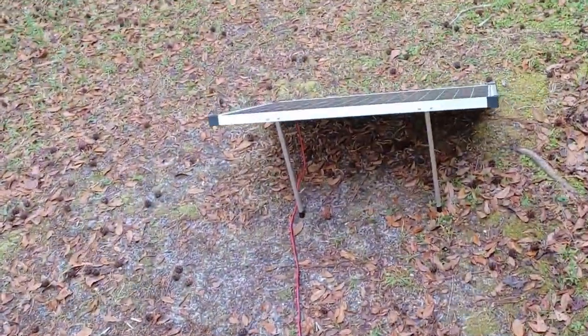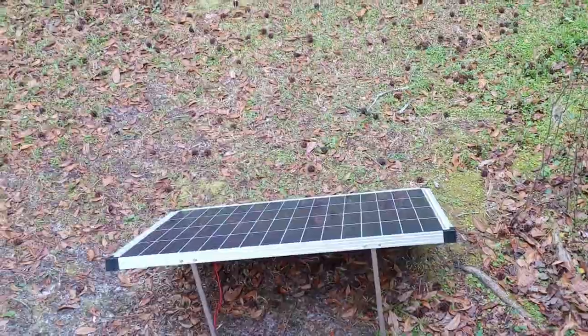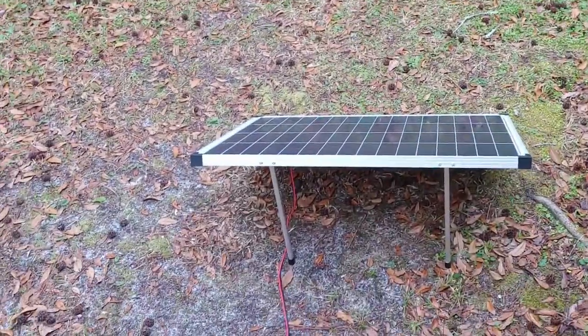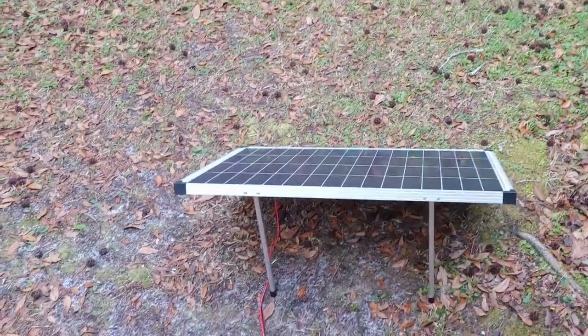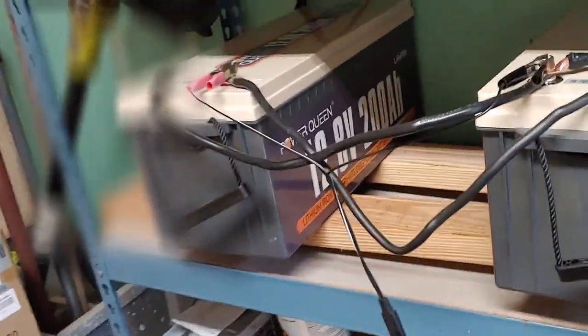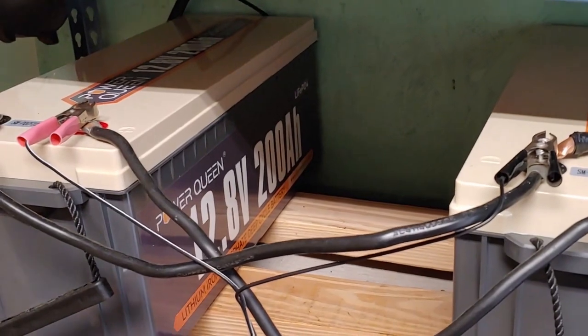It's fairly simple, easy, and it works — 100 watts worth of solar power going directly into the battery when needed. If your system requirements are less, you can use a 25-watt solar panel for critical times, or smaller or more depending on your needs. I do not have a charge controller on this because it's never going to damage the batteries — it's only going to be connected during the day when everything is running and I need extra power to keep the batteries charged. Even then it won't become fully charged because power will be coming out and going back in.